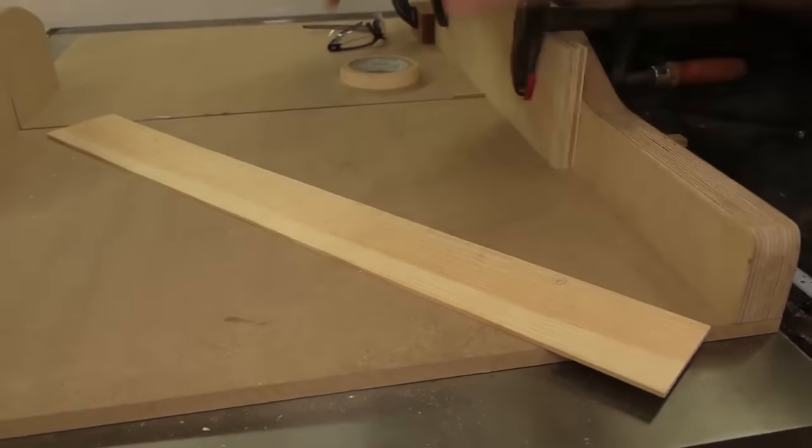Tom Carlo's asking, would the no clamping method work with thicker stock? You'd have to test it. The main thing is you just got to get those fingers up tight enough. I think as you go thicker, you might find you have to hit that sweet spot of the fit. The fit would have to be just right, that once the glue hit it, the fingers weren't too loose.